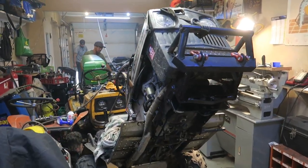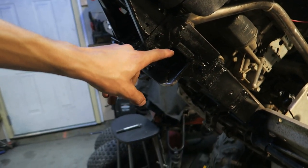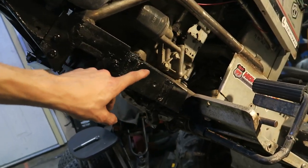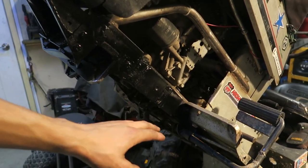All right. We are giving her hard. Doing some painting, some grinding. We added in bump stops there so the axle can only flex so much now. Reinforced the frame. As you guys can see, we cut off the old steering with the plasma cutter, which worked out great. We plated that over, ran new welds over it with the Eastwood 180 MIG.